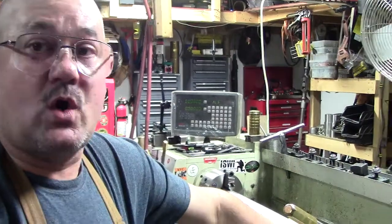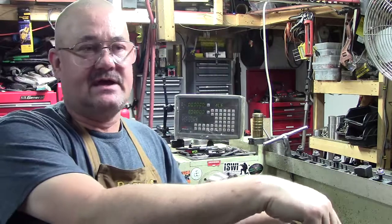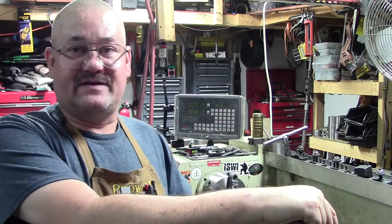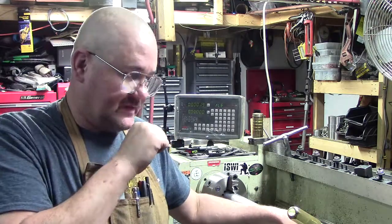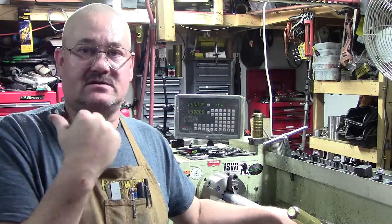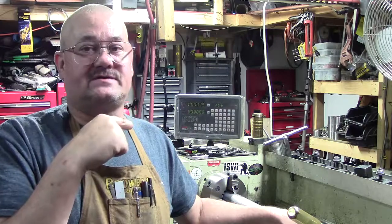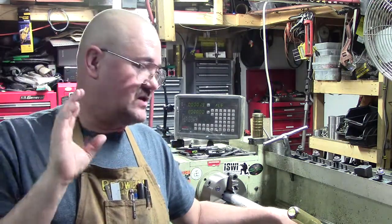But we have to turn the whole diameter down because the table slides on the drill press. And so this is 2-inch. We've got to turn it down to 1.852, which is the diameter of that tubing. So yeah, I got to looking around, and the price of this versus steel or some DOM tubing, way cheaper to go this route. Plus it's 6061 aluminum. It'll work. And so here we go.